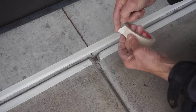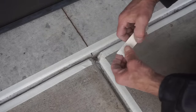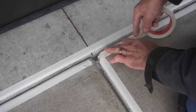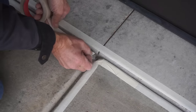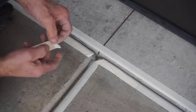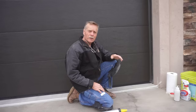At cross or T-intersections, I use a special technique with the tape to get nice crisp corners. I tear the tape so it has a kind of an angle, and then start that angle right down in the joint. I tear the next piece with an angle going the other way and match up the corners of the tape so that when I peel back, there's a nice sharp corner. I'm basically mitering masking tape. And with the masking tape down, that's the end of the prep work.